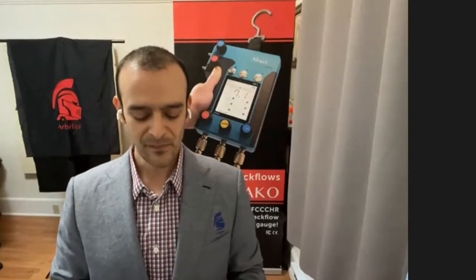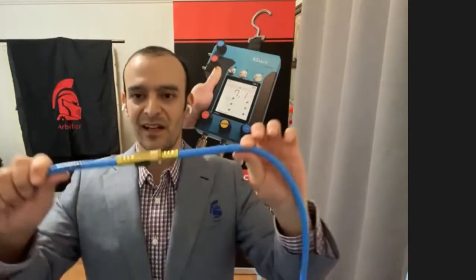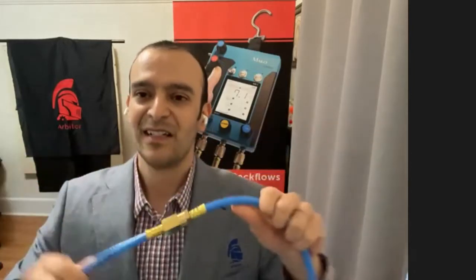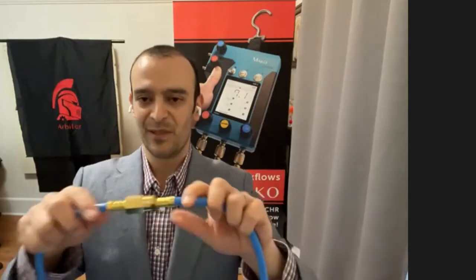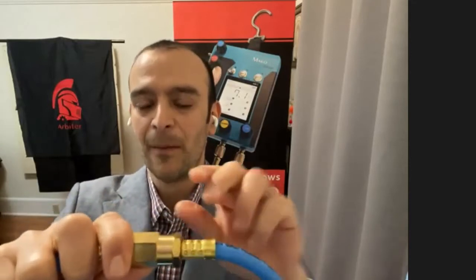A common complaint of testers when we asked them about their hoses was their leaking filter housings. Well, we saw the ones on the market. There was a lot of plastic ones that were leaking. So what we did was we changed that to an all brass housing so these can keep their dimensions better. We also put a double O-ring seal in here.